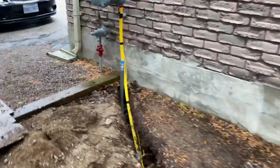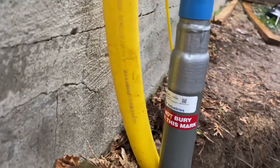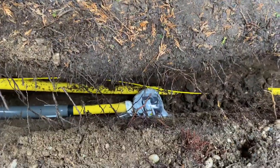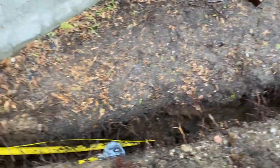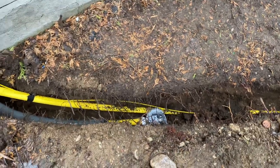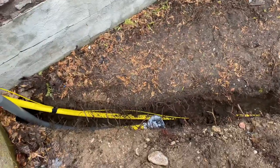Just to show you, here's a mock-up of the riser, and 'do not bury above this mark' — so that's a great depth that I have, and I got the plastic bag there over the coupler. Come the next day on both sides, like I said, because I left eight feet, I'm going to pull this out of the ground, mark my spot where I want it to be, do my connection, put it back in on both ends, and then I will backfill — and that'll be that.